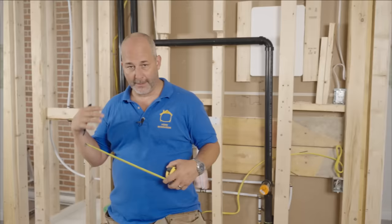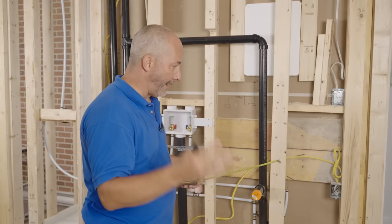Okay, so first step when you're doing a project like this is make sure your drywall is the right size. You wanna avoid any butt joints. And that's when you have the 4 foot side of the drywall up against another factory edge. You all know butt joints, they're extra coats and it takes extra time. To make things speedy, buy the drywall the same length as your wall.